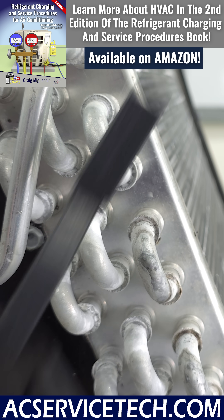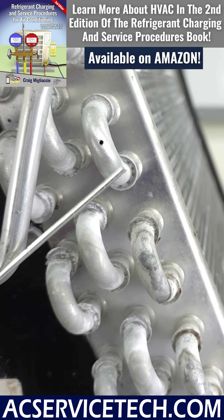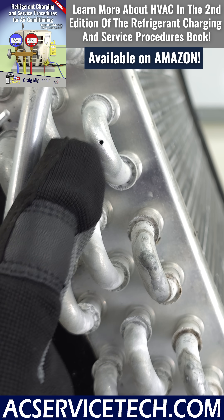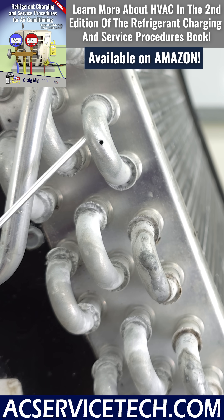It's important to note that this aluminum tubing is going to melt at about 1200 degrees Fahrenheit, and the solder weld rod melts at about 600 degrees Fahrenheit. So you don't want to just keep the torch in one spot and potentially melt the tubing. You want to move it around a little bit — you've just got to get this tubing hot enough to chemically bond with the rod.